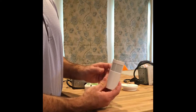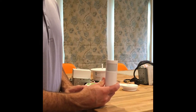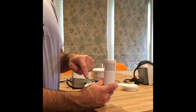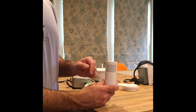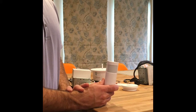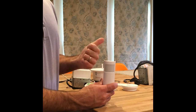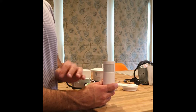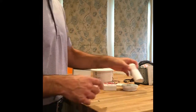The Vive system also has wall-mounted sensors. These would mount between six feet and eight feet high and can see much further out into space. This one can see up to 60 feet away, and we have a hall sensor that can go up to 100 feet. So if you're doing a project that has mostly office space but also some storage space or long hallways, that's where you'd want to use this.